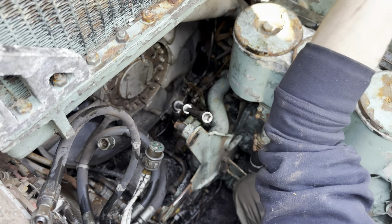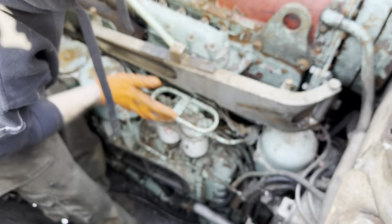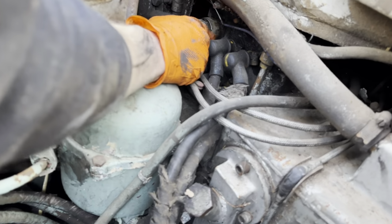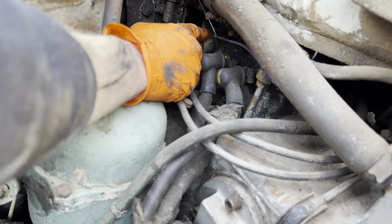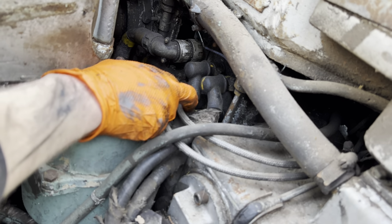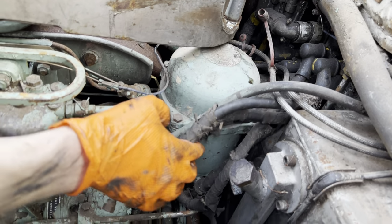Okay, and then basically what I'm going to do next is there is a series of connections on the bulkhead here. This is like your main electrics for all your start, your crank, your oil pressure, lights, your temperature and all that. These are your main power feeds and obviously your generator. These two epoxy ones here are your firewire, which they're never going back on.